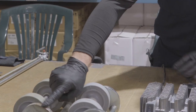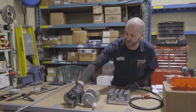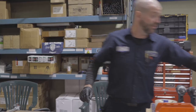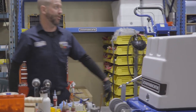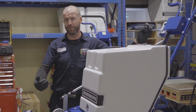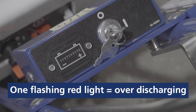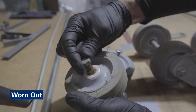We've got flat spots inside the runners, and we also have some wear in the keyway where that arm sits in. As you engage it into the cut position, it's going to take away from the overall cutting height, so your minimum position now becomes your maximum cut position, and it's going to over-discharge the batteries, giving you a shorter shelf life on your unit.